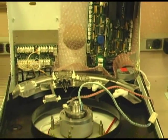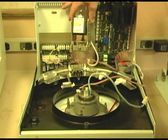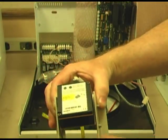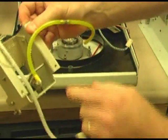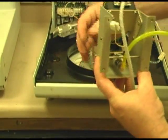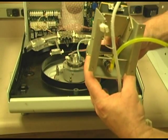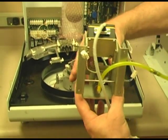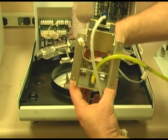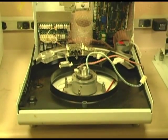Next, what we're going to assemble is the barcode reader. The barcode reader comes in here — you can see the mirror right there. This is activated by air — a pneumatic signal that essentially moves it back and forth. And that's what picks up both from the slides and from the reagents; it just reflects the barcode. That assembly sits right in here.